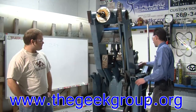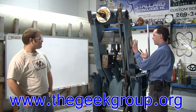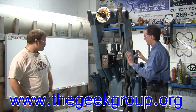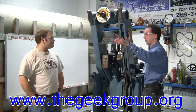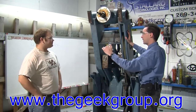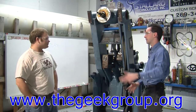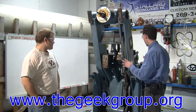We're going to take this off, which we have to do by getting off the four bolts back here. This one doesn't slide off — it's just going to pop. The way we're going to do that is we're going to grab it with a forklift, put that through here to support it, lay it down as far as we can with the forklift, and then pop the bottom and set it aside. Kind of dangerous, but we should be fine.